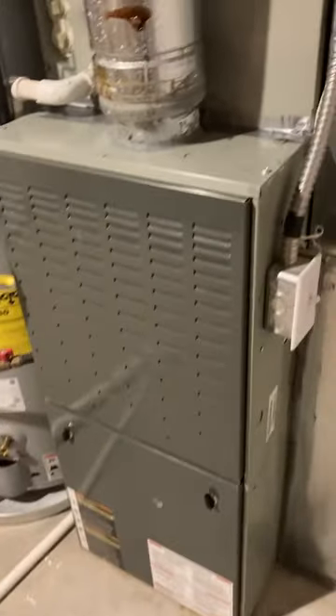As we go down to the basement, there is a utility room. The step-down transformer for the doorbell is actually right here on the side of the furnace. This switch provides power to the furnace, but this step-down transformer is not connected to the furnace whatsoever.